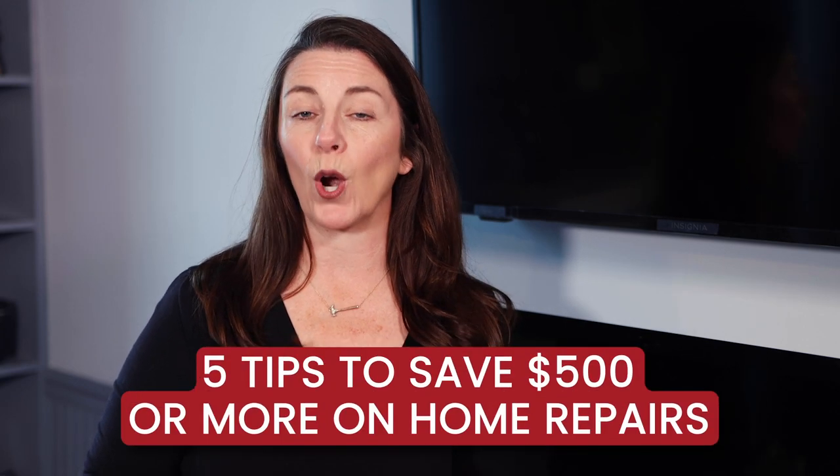In the description I have a bonus for you — click the link for five tips to save five hundred dollars or more on home repairs, and I'll send you a PDF of my top hacks to save you from calling a repairman. Every television mount will be slightly different, that's why you need to read the directions, but the basic premise is the same: find a stud, make a bridge if you can't find one in the right location, have a buddy to help you lift the TV into place, hide those cords when you're done, and make sure overall placement is key.